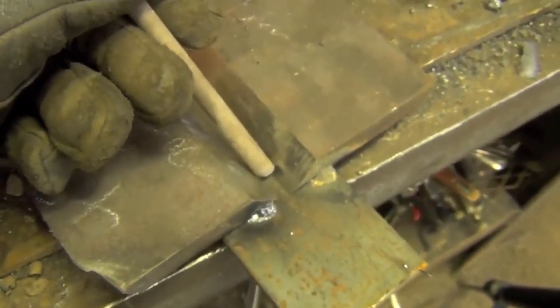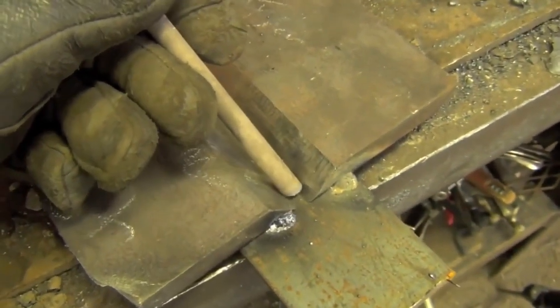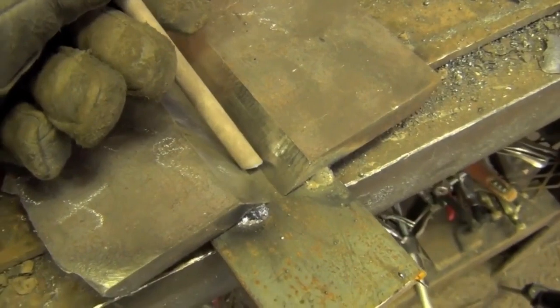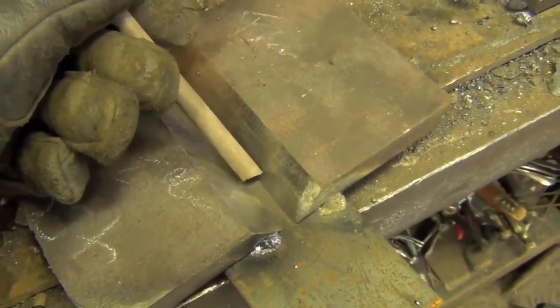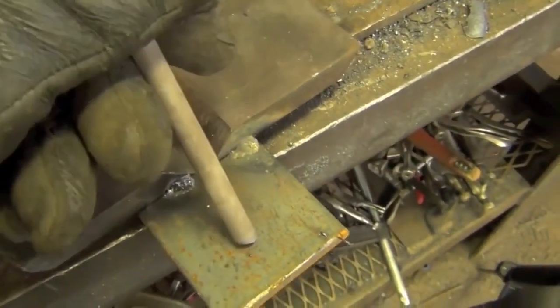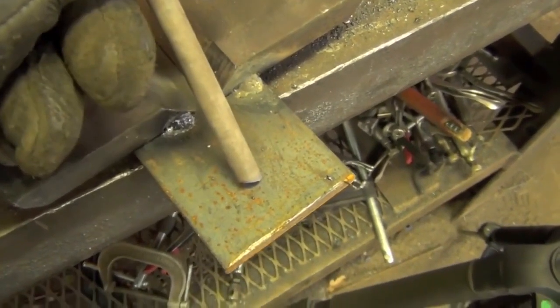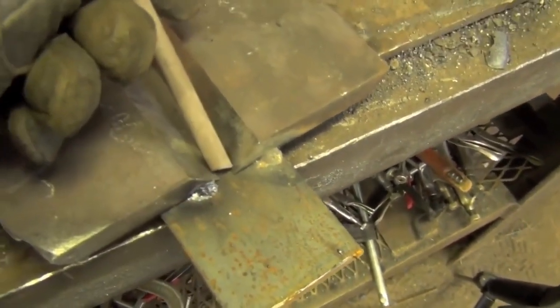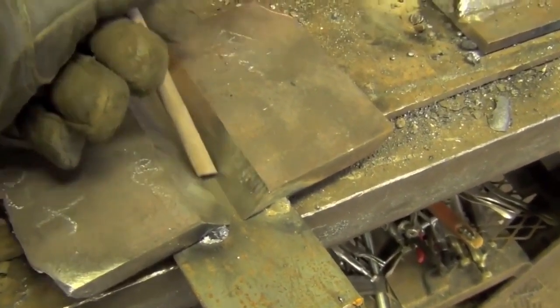And if I were gonna start that, like if I was welding this here and I started it right in here, a chunk of that slag can fall off, and then I run back over it when I start the puddle, and then bam, instant slag entrapment. So we obviously don't want to have that. Thus, if you start here, when you bang this thing on the metal to start the arc, that piece of flux is going to fall off here, that piece of slag. And then when you long arc over, you just have the arc and fresh metal you're putting down.